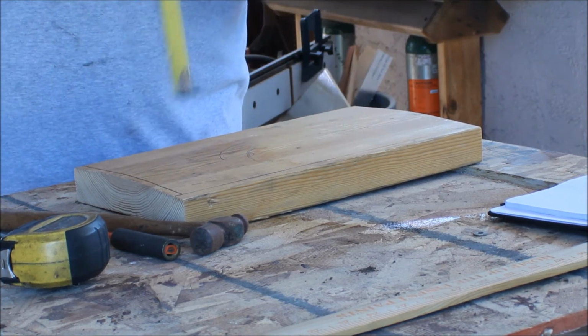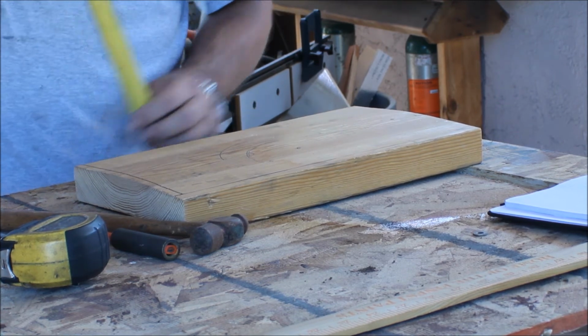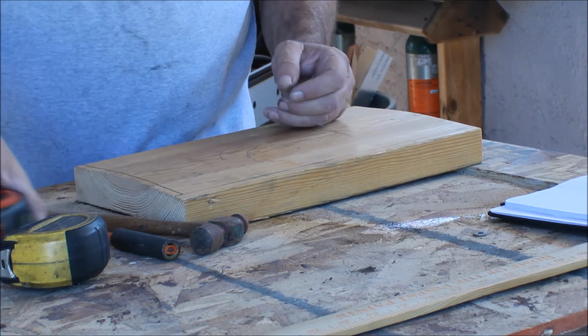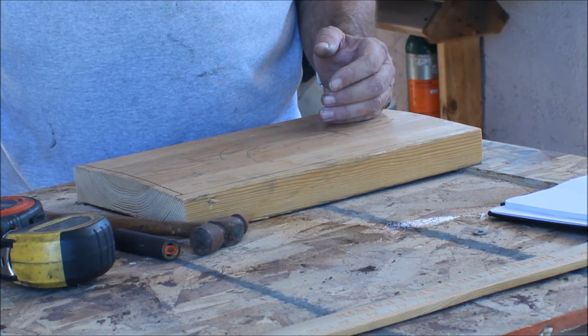This becomes a fish tape. Fish it all the way down the wall, hook your wire up on this end, and with that retracting button, you can start to bring it up to the hole where you're at. So it works like a fish tape without having to go out and buy one, okay? So that's a nice advantage right there.